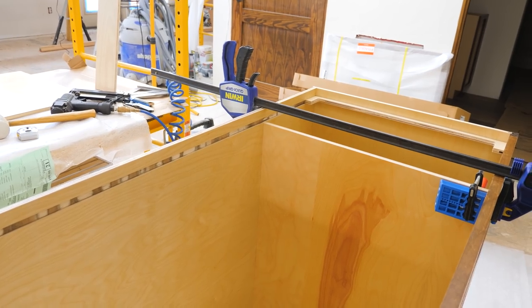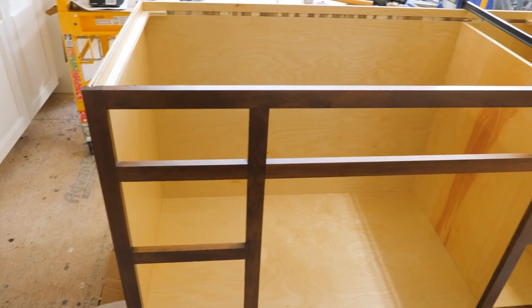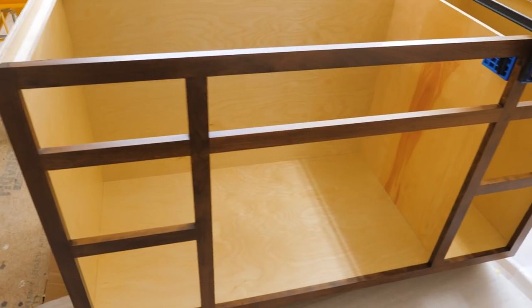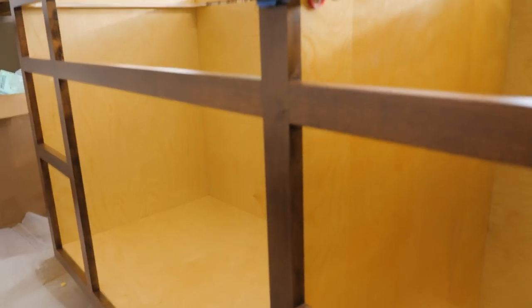If they did pre-rout and you didn't want to use the dividers, you'd have ugly dados visible. So this option is for people where plumbing comes in at a weird place and you don't want a divider panel in the way. We don't have that situation, so I'm putting these panels in to separate the drawers from the sink area. You just have to measure the space between the wall and the inside of the face frame — mark it. It's 11 and a quarter. Run a pencil line and line up your inside divider panel to that line.